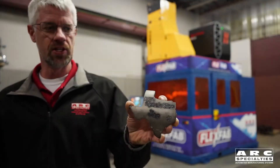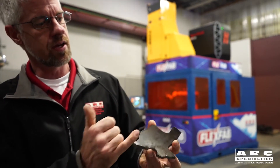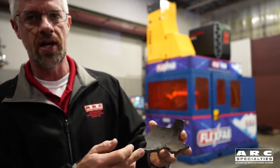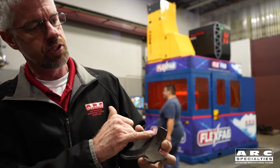This is the finished cut. You can see we etched it with plasma. Very little slag on the backside. That's a fairly complicated part and the robot has to slow down through all the curves, so we get a little bit more slag on the tight spots than we do on the straight edges.